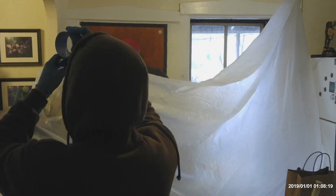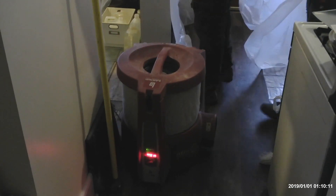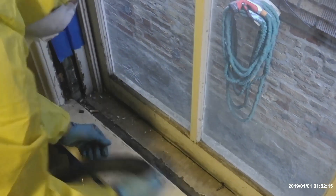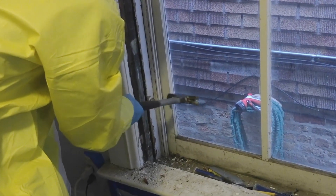We've got two layers of plastic on the floor, we've covered everything up in this area, and behind the camera we've got that air sealed with a HEPA fan running to catch any dust and dirt that might get into the air. Once he starts removing the window we'll do the replacement, then roll that first layer of plastic up, bag it, and mop the floors after. We're not worried about big chunks of lead paint — we're worried about the small particles created when cutting the stops with a knife, which is when you create lead dust with potential to be inhaled.